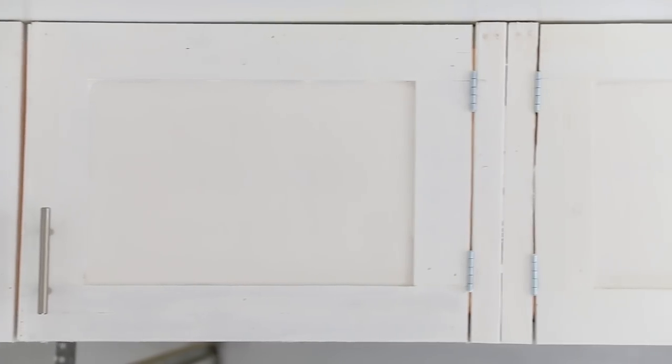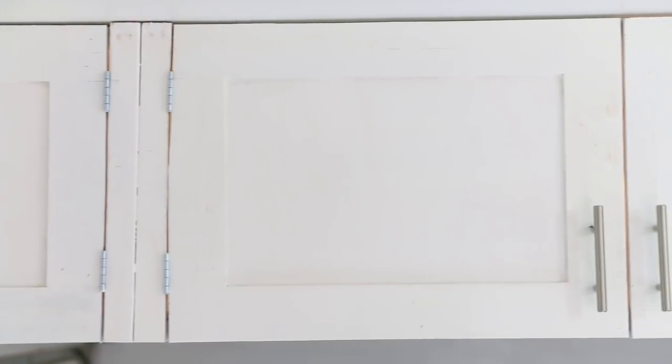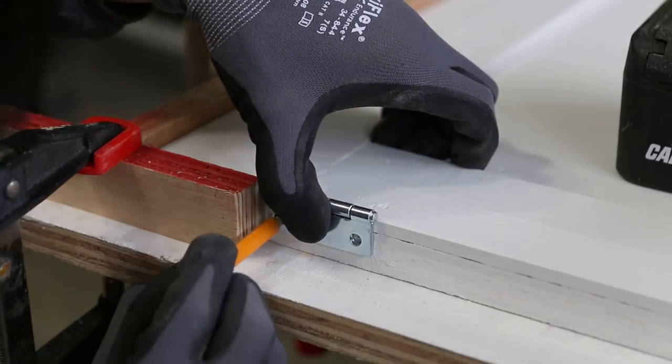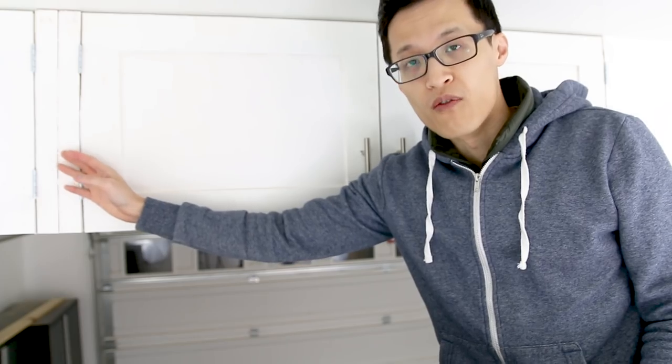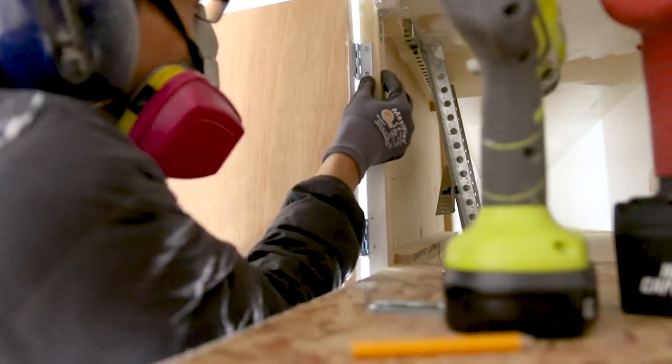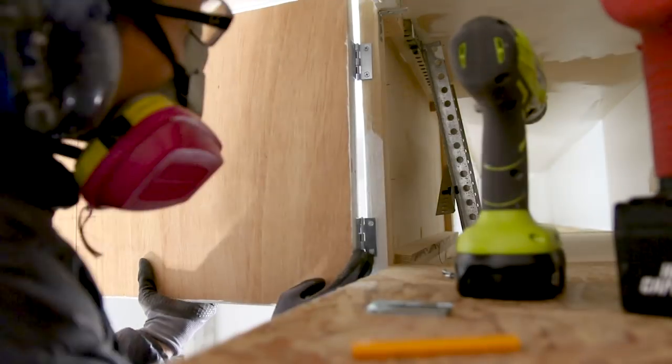Use the scrap piece of wood as your template to drill your holes. This will speed up your work and make the placement of your cabinet pulls consistent. To install the cabinet doors, I used simple 2 inch hinges, and this is where I ran into a lot of problems because I did not make sure my front supports were level vertically. How I remedied this was I sanded down the front support or the door to make sure it was more level so the cabinet door would install properly.